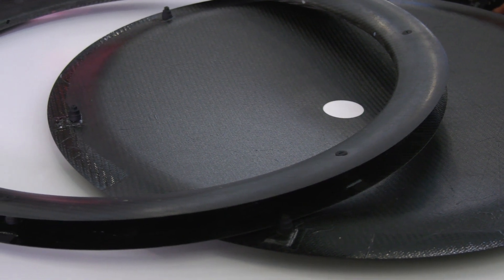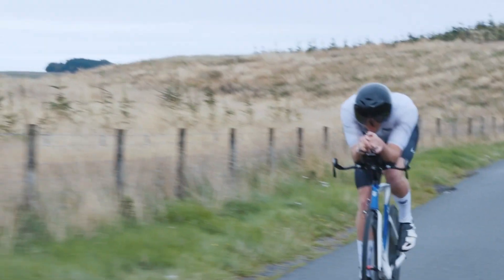The process to make these — I realised quickly that I needed to make a mould to make these carbon fibre parts. So the first step was to build a CNC. Essentially, the carbon fibre is laid up into moulds that I make, then a vacuum system is applied, they go in the oven for an hour, and they come out. After that you need to trim them — I have a CNC router that trims around the outside of the parts, trims the inside, and also cuts out the attachments. Then you fit these small attachment parts that allow the covers to fit together with a quick-lock attachment.